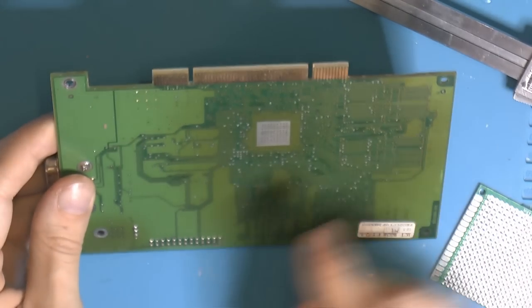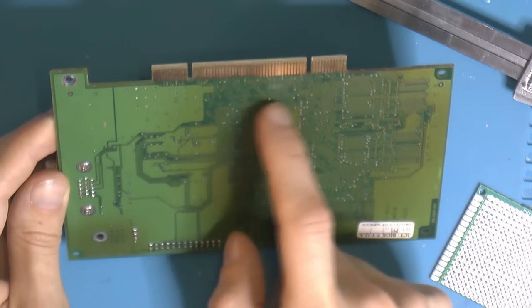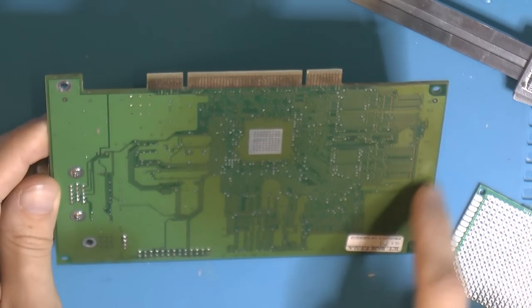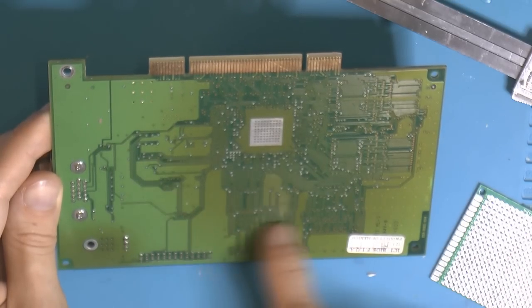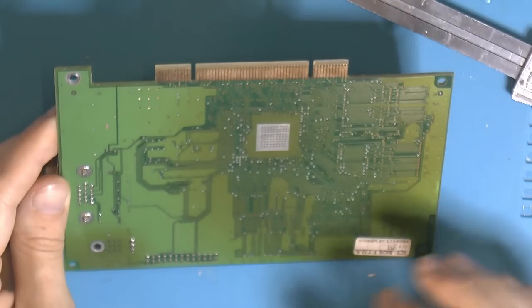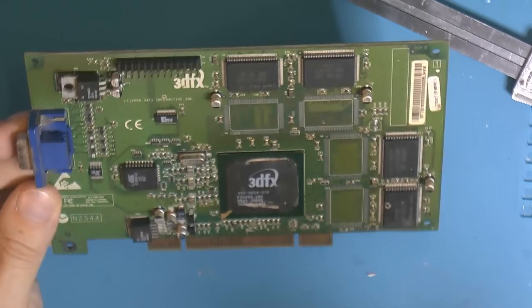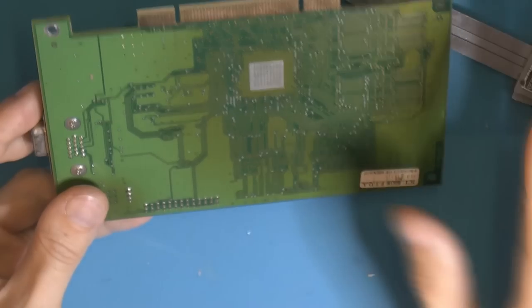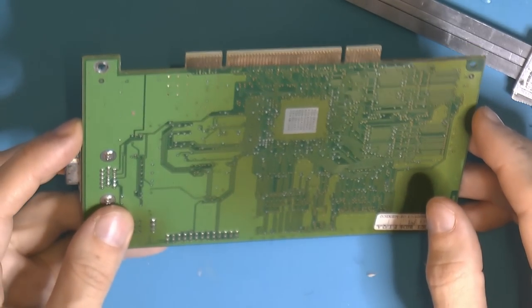So yeah, checking the footage, like I said, discoloring here, normal. Around the GPU here was normal, but this outside here is from the hot plate. So even at 130, 140°C, you're getting this over time. Maybe one can run it for a shorter time and get the temperature down even more. It affects the aesthetics. Technically, maybe the epoxy quality too, in terms of strength and stuff.